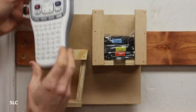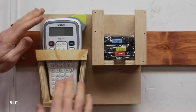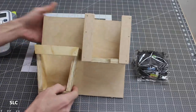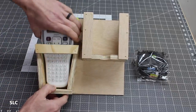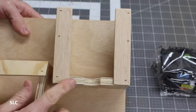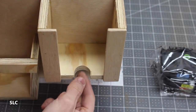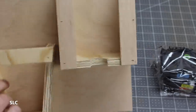If you like labeling things in your shop, I'd definitely suggest getting one of these p-touch labelers. I also built a nice housing not only for the main unit but also for spare tape. The back is about 1 1/8 inch plywood and I've just used plywood all around. This right here is almost in a V-shape — that's how it fits the contour of the body so it's nice and secure, and I just used a piece and a front hanger just to make sure it wouldn't fall out the front. For the cartridge holder, it's real simple — just basically an open box. I do have a lip here on both sides to keep anything from falling out the front, and I also drilled out a hole here so I can easily get my fingers up underneath them.